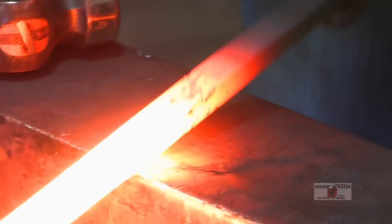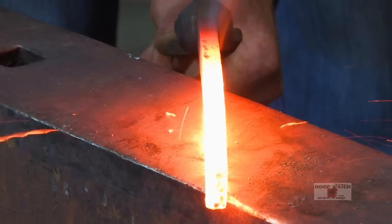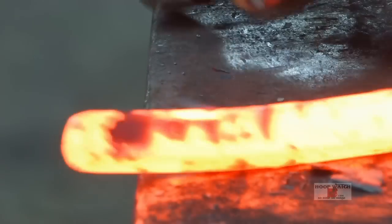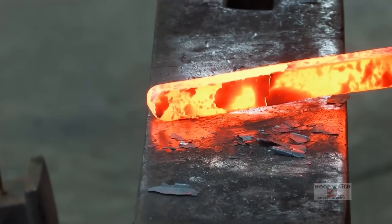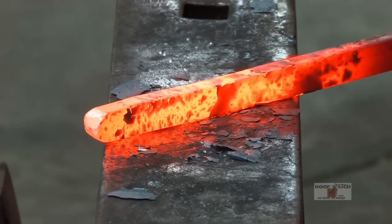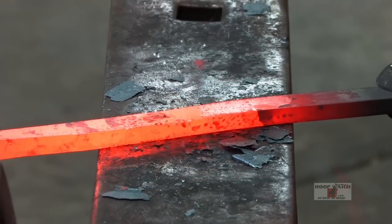All right, this is a piece of 3/8, 3/4, 11 and a half inches long. I'm gonna run down the branch and kind of hold everything at an angle to where I make a bit of a wedge. Come on around the outside edge. So I'm just forging a nice heel. This will give me some material to make it a bit thicker, because the medial aspect of this branch of shoe is thicker than the lateral aspect of this branch of shoe, I'm sorry.